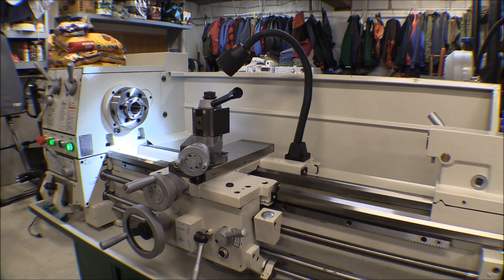I've got to level this up or put some wedges underneath to stiffen it up a bit. I don't want to anchor it to the floor for a couple of reasons: one, this is not its final location; and two, I've got PEX pipe running through the floor for in-floor heat and I don't know exactly where it is — I don't want to risk drilling into it. The floor is not perfectly flat, so I'm going to use wedges to stabilize and level it. My first real job with this lathe is to turn down a shaft for the tailwheel steering fitting that goes into the rudder — the shaft is too big to fit into the tube on the rudder, so I need to turn it down.